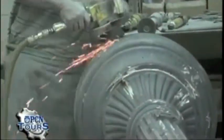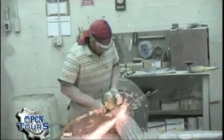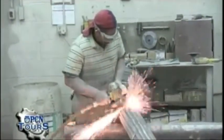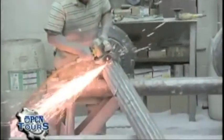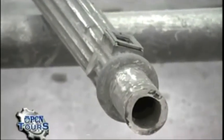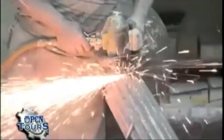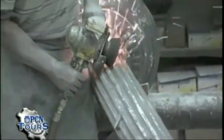Because we're a foundry, our custom capabilities allow us to cast this embossment directly into the pole so that we're not mechanically attaching anything nor doing any welding. Other manufacturers really can't do this because they're not doing the actual fabrication work — they're buying the product and bringing it in. We're making the product, customizing it, and being able to cast in banner arm embossments, GFI receptacles, decorative seals, flag brackets, or any other custom applications needed for these particular poles.